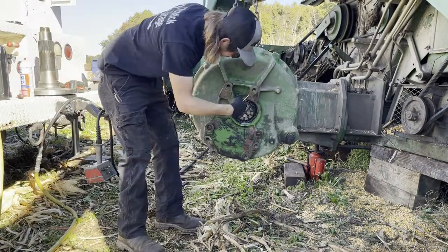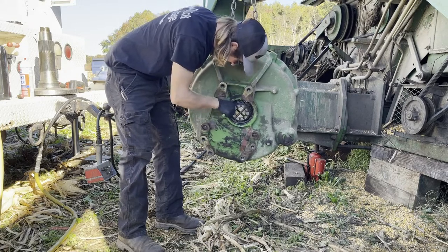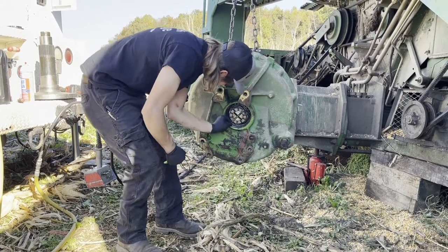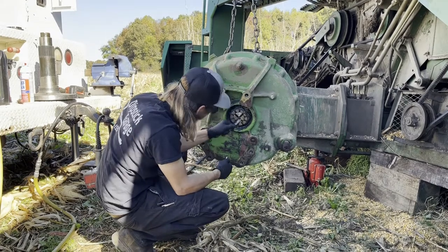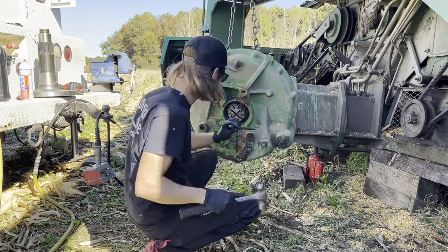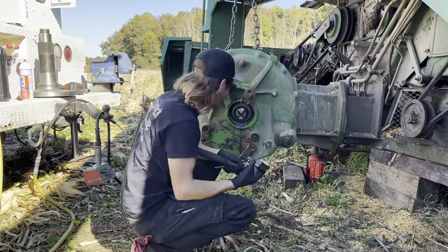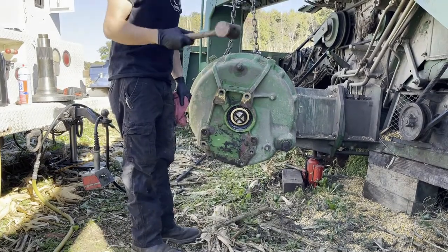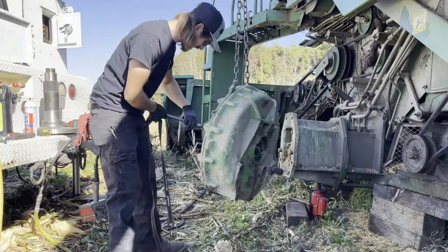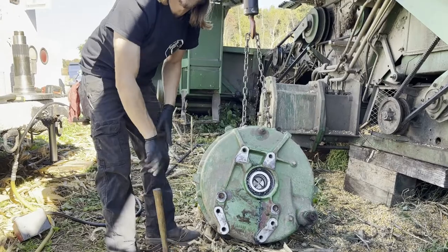All right, so to get that axle out, you take that cover off the back real easy. Take this snap ring out of here, and then that little guy right there is gonna come out of there. Get the appropriate size socket and ratchet. Just twist that bad boy right off there. Grab your copper pecker and hold still. Quit turning. Helps if you don't have to fight gravity.